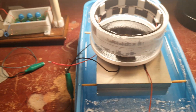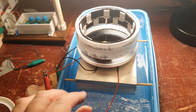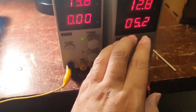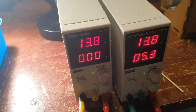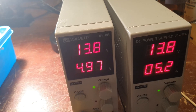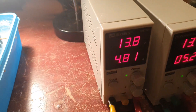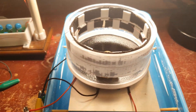We hook up our Peltier plates, and we've got our heat sink with Peltier plates in the ice bath. I found it works best to have each Peltier plate on a separate power supply. I adjust each one to 13.8 volts — the maximum for these Peltier plates is 15, so I keep it a little under the maximum rating. They both draw about five amps when powered.